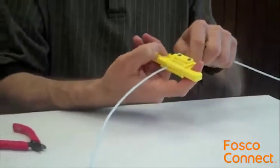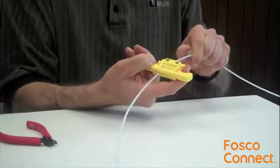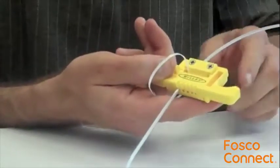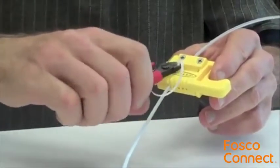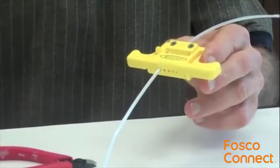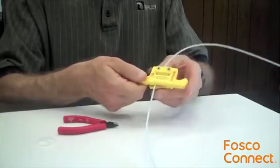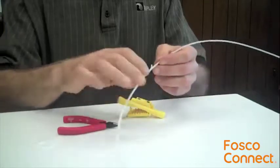Grasping the handles of the tool, slide the tool along the tube with a slow and steady force. During the shaving process, the residual buffer will be evacuated through the slot on the top of the tool. Once the desired stripping length has been achieved, snip the shaved buffer tube from the stripping channel utilizing the Miller 9150 diagonal cutter. Open the tool by pushing the protruding locking tab from left to right, completing the stripping process.